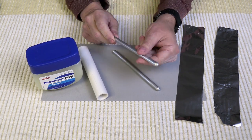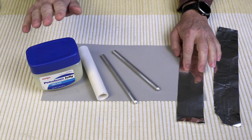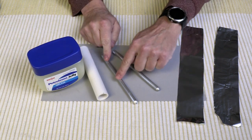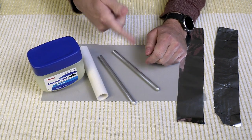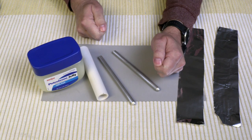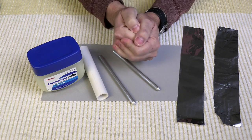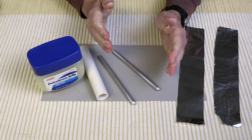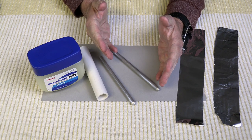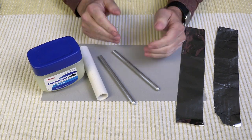I'm going to prepare the coring tool or the mandrel by wrapping it in aluminum. But first, I want to use petroleum jelly — sometimes called Vaseline — to coat the mandrel so that when I wrap it with aluminum foil, I'll be able to pull it out of the propellant after it sits and hardens. As the propellant cools, it will shrink and really grab hold of that mandrel, and if you don't use some sort of release agent on it or the foil, you won't be able to get the mandrel out. It really clamps on there hard.